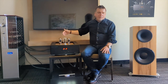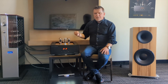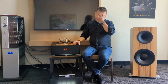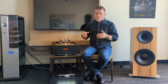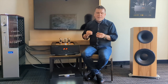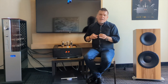Another two interesting inputs are I2S, or I2S as some people say. It's a 4-signal connection that connects the source of data with the DAC. It's a very interesting connection, but also very difficult to implement because I2S is not a standard. There is no standardization between companies. So both the plug and the cable can vary wildly, and the data transmission protocol can be very different. It can be balanced, it can be single-ended, it can be low signal, or it can be high signal TTL.